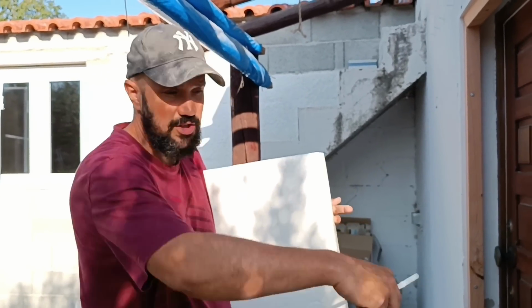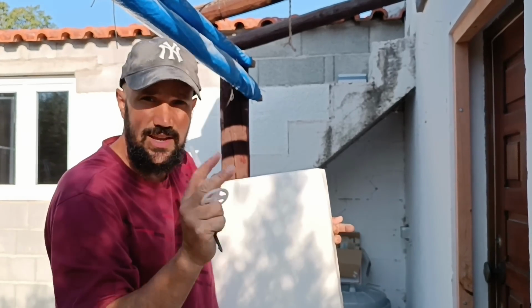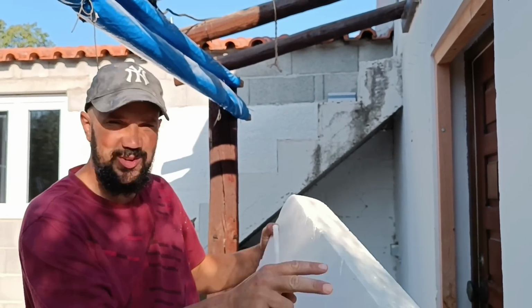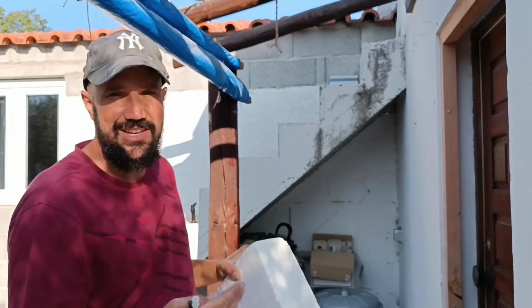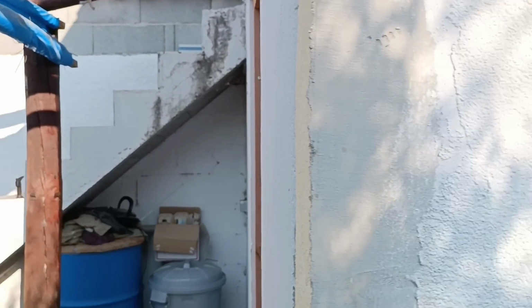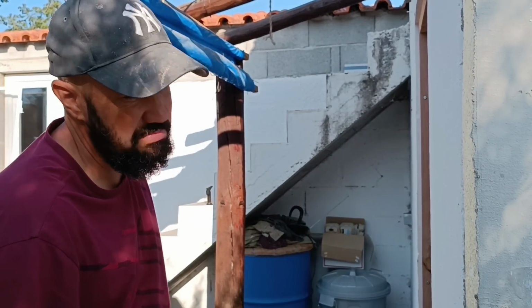So we have the glue, we have the fittings. So another layer of glue goes over the top of it with a layer of fiberglass mesh in it before you render. And that just prevents it from cracking where all the joins are. It holds it all together. It's an extra layer of fixing as well. And really good. It becomes more solid than what I thought it was. It would be, considering it's styrofoam. Obviously, it's not going to stand up to something sharp hitting it hard, but pretty solid.